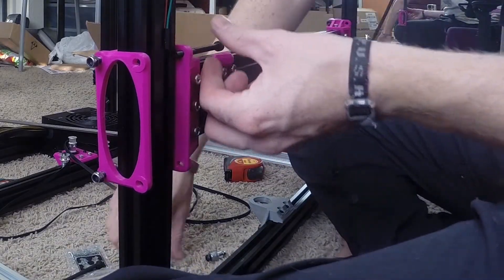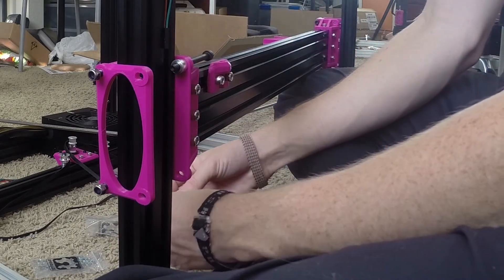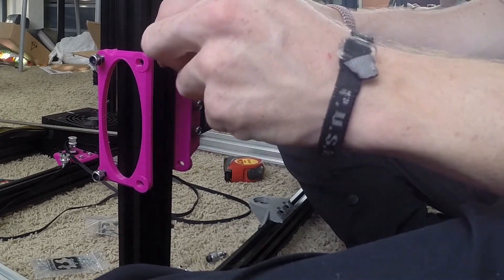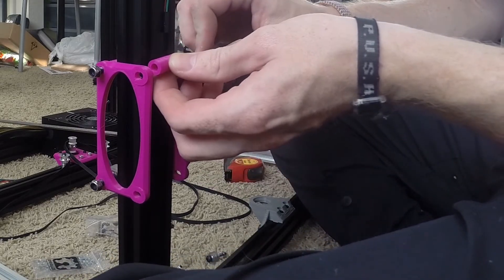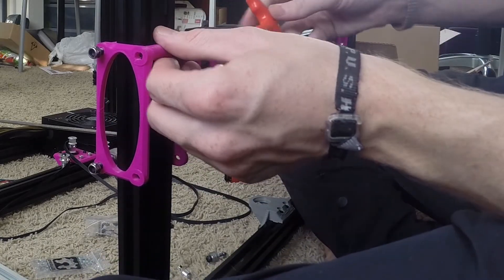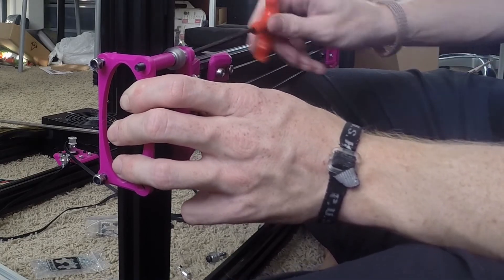Next we're attaching the actual cantilever mount for the Z bed. This bar will be the one that actually attaches to the frame and moves up and down. You can see the order of operations here. First we've got an M5 bolt that goes to the whole bracket set. We have four of the same kind of wheel assemblies: it starts with a washer, then a spacer, a V wheel, another washer and spacer — this nice magenta spacer — and then finally a last washer, and the bolt goes through and attaches the whole thing. All four bolts are attached the exact same way, so there are four wheels per side to keep this cantilever gantry mount nice and sturdy.